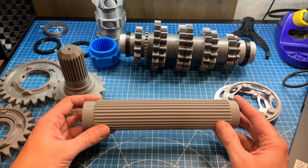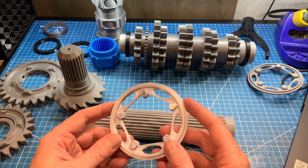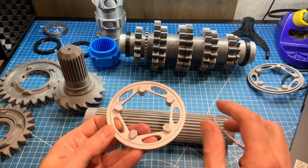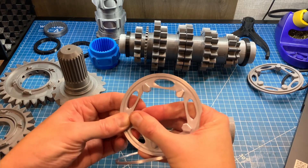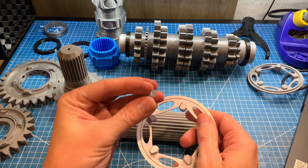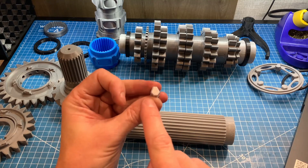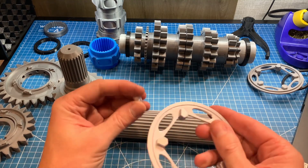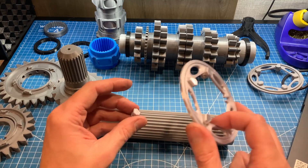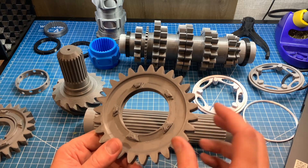On to the main shaft. The gear order is going to be the same as the lay shaft — obviously the gear sizes are reversed. I'll start with the sliders themselves, which are eight pieces each. This isn't ideal, but this is a complex shape to try to 3D print. On my last gearbox, these pieces tend to break during a missed shift, so the parts are printed so that the layer lines are oriented against the stresses. I just super glue all the parts together, and when I glue the dog teeth I check to make sure that it can still slide smoothly on the hubs. To make sure the dog teeth on the gears are stronger with this gearbox, I've actually printed this center section essentially 100% solid.